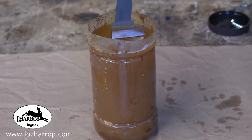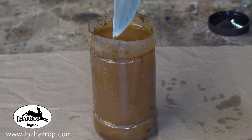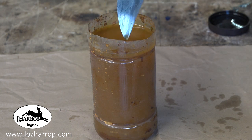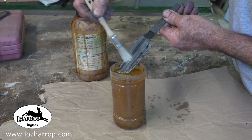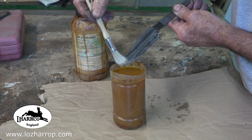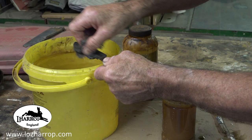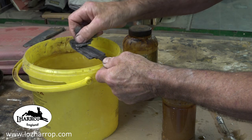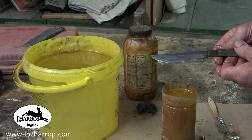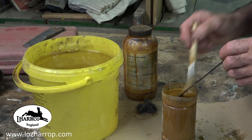But when it goes into this ferric chloride, it just jumps out straight away. Now the etching cycle was really prolonged on this. I don't know how many cycles there were, maybe 10, 12. It's a weak solution this, so leave it in the ferric for 10 minutes, 15 minutes, wash it off gently with wire wool and a cloth, keep going back in, etching the 1095, trying not to disturb the nickel layer too much.